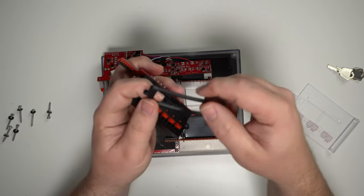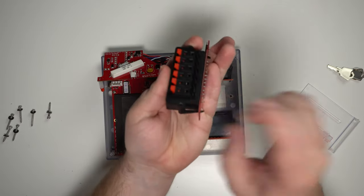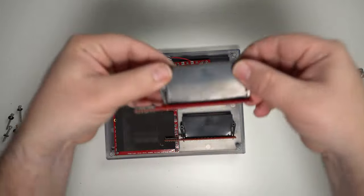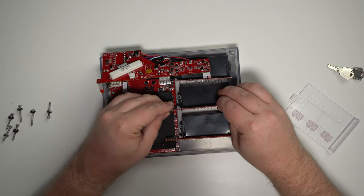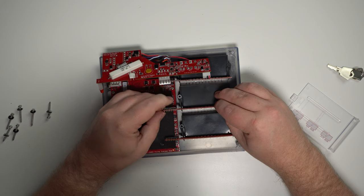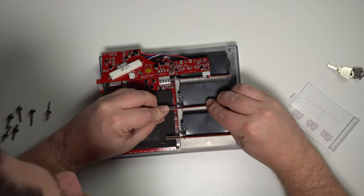You'll put the thinnest edge of the seal away from the red circuit board — just like that. Then, just as easy as taking it out, we'll go ahead and seat that back in the module, making sure that all the pins line up with the plug on the main board. And we've got the new Q-strip seated into the module.